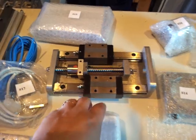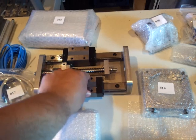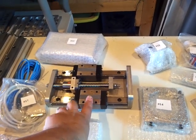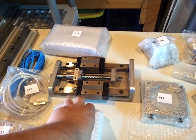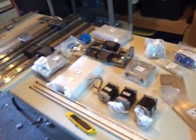But part two, this is everything. The Z-axis is also 20mm ball screw, 25mm rail and carriages on the Z-axis too, with I think 4.5 inches of travel space. And that's plenty of what I need. That's all the parts unassembled so far.